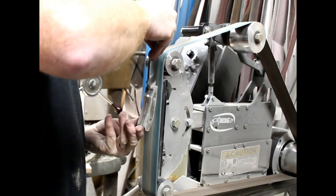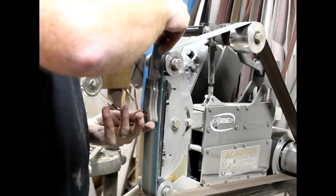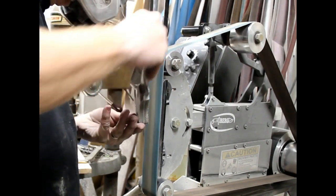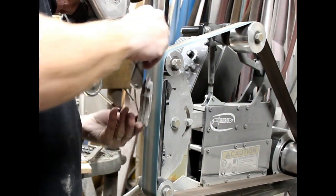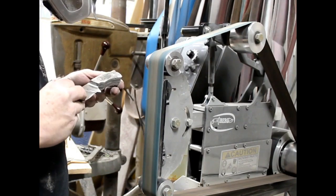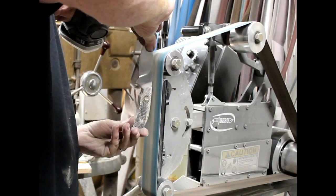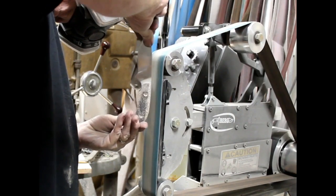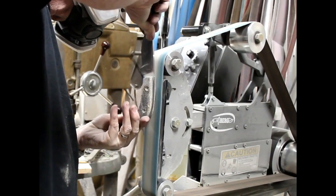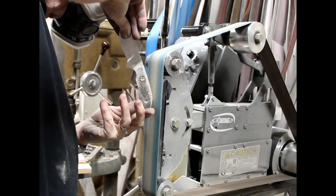I usually round over the top edge of my scales with them in place on the blade. I also finish the profile of the handle material and match it up perfectly with the blade. I'm not going to show you the entire process of shaping these scales, but this micarta basically shapes like wood — it sands pretty easily, it's easy to cut, easy to shape, and it should be fairly easy to polish.